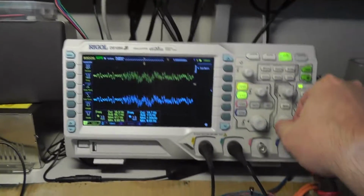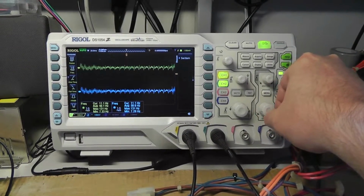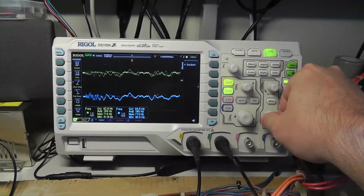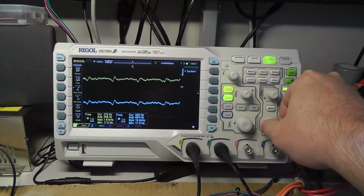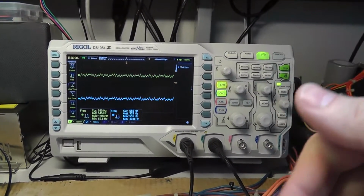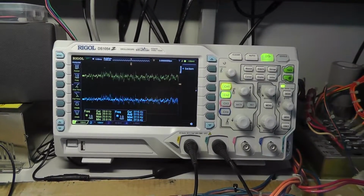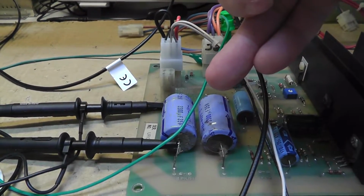I could go down, really try to get more granular, I guess. 5 milliseconds. And it's matching up almost identical. It's almost like the capacitor is having little to no impact on the frequency response or blocking lower frequencies. 3300 microfarads. Did I show that?